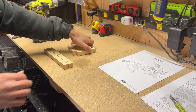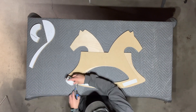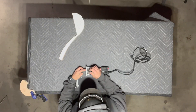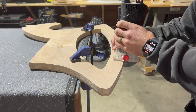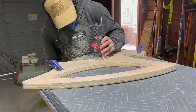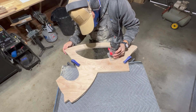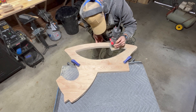Now that I had everything rough cut, I decided to go back to the templates and use a flush trim bit with the router to get everything down to its final dimensions. What I used here was double-sided carpet tape. It worked well — a little too well, actually. It turned out it was extremely difficult to get off. One thing you may have noticed is my complete disregard for dust removal. I just threw a mask on and figured I'd wash it off later.